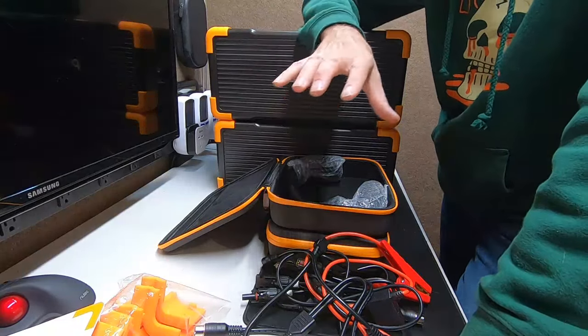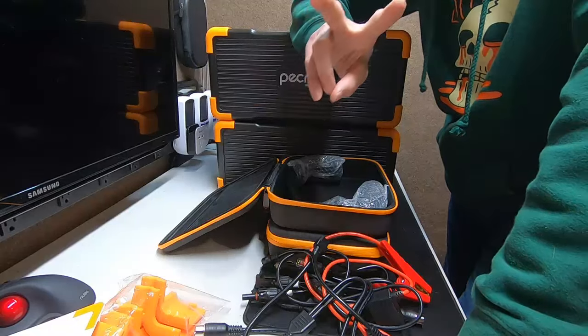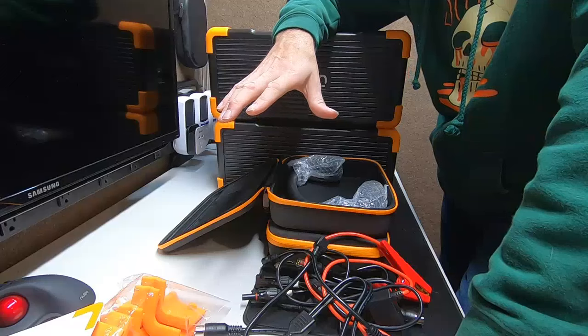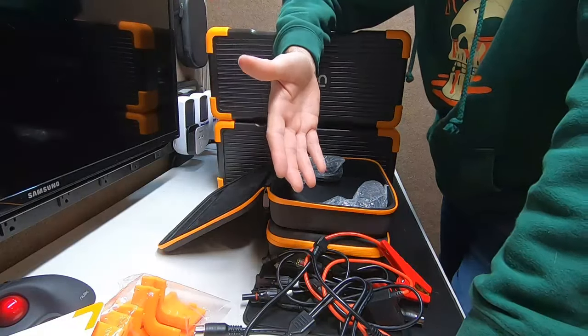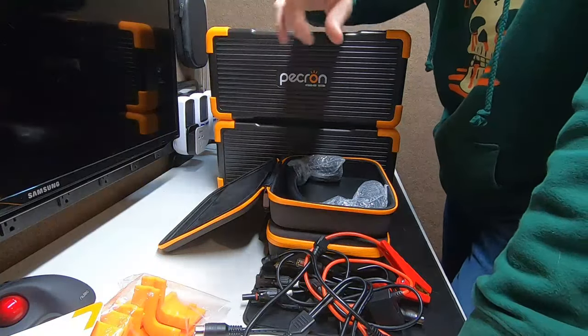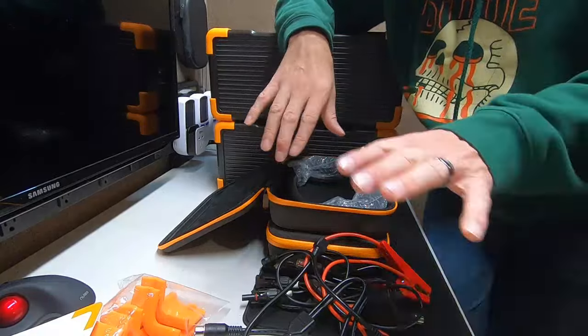So what happens is, if the panels are really cold and you get a spike of, let's say, just 2 volts, being that you came in at 94 volts and you spiked up to 96, what does that mean? You're 1 volt higher than what it says it can handle. That's why if you look on the ratings of all solar panels, everyone, I'll grab one here.